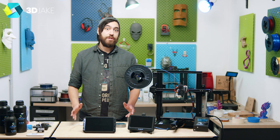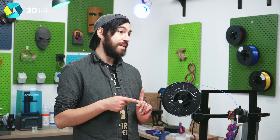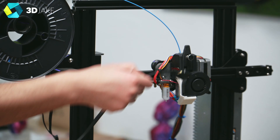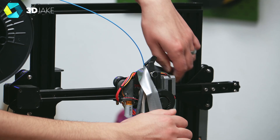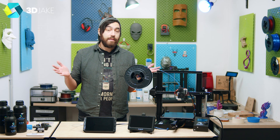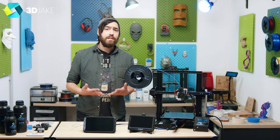Click OK again as a safeguard to ensure the firmware is flashed and the printer is attached to the pad. It will say the firmware has been flashed successfully and you can begin the self-test process. The only remaining thing is resonance calibration, which is a bit difficult if you've modded your X-axis assembly — but that's what you get for frankensteining your printer.